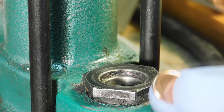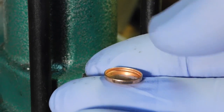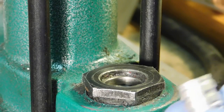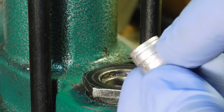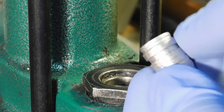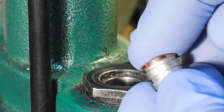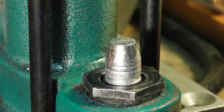So there's our station. Here's one of our Hornady gas checks. You see it's a little cup and it has a little flange, so when it's run through the sizer die it actually crimps that in. And if you look carefully, the little instep for the seating of the gas check has a little extension there that actually sticks out, a little protrusion, so that when it crimps in, it crimps the gas check above that little protrusion. And that is a very nice arrangement to get that gas check to be on there.